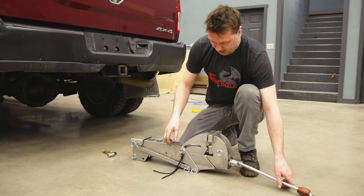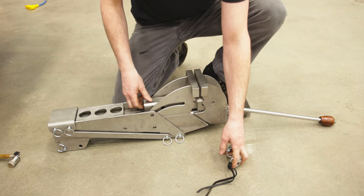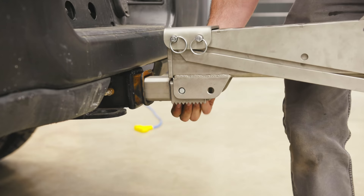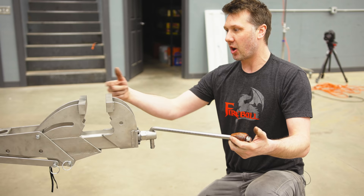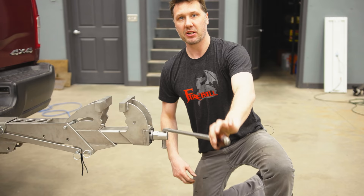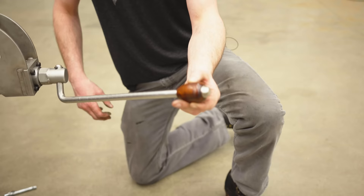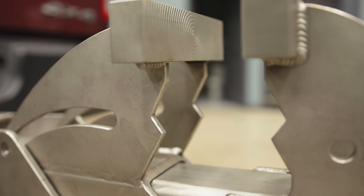The jack is in the neutral stored position. Let's pull the handle out. If we pull this pin and this pin, what comes out is the drag link — it looks like a two-inch receiver tube that goes right into the back of the truck. Now we've got a vise on a truck. One concern is how well this handle holds its shape — will it stay bent? To open and close the vise fast, if you just make a circular motion around the pin the handle opens quickly. We put the swivel on the handle so I can just grip it with my fingers. When we want power, we can come closer to 90 degrees. It's very unconventional but I think it's going to work.